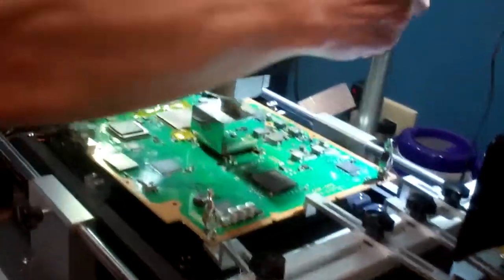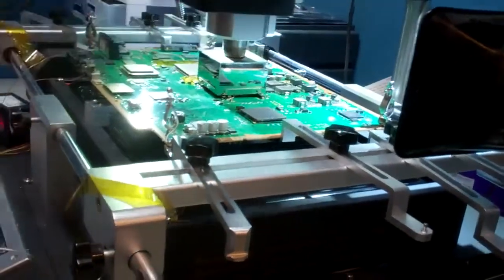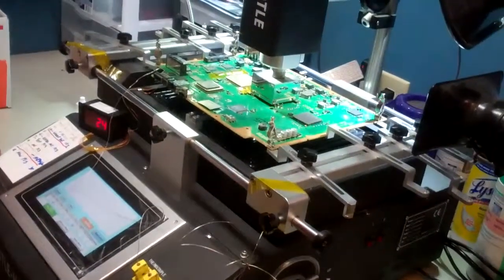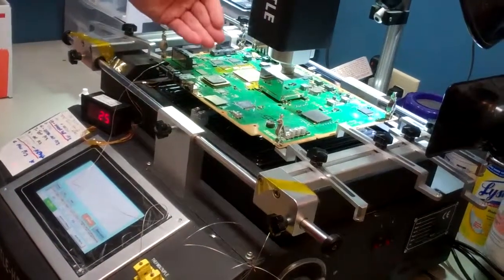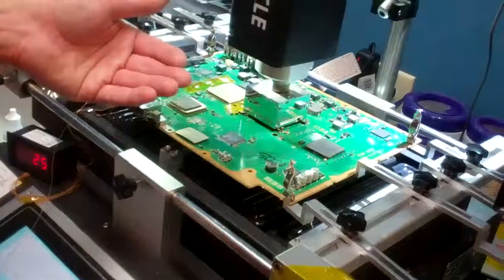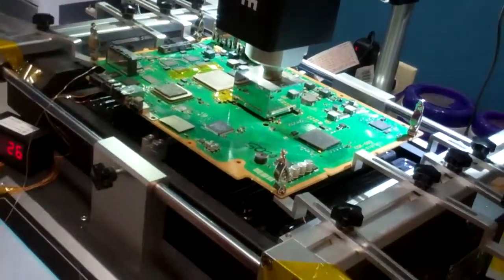So now we're all set up in place. We can position our upper nozzle and start our reflow. So that would be how you monitor the PS3. We're going to make another video on the Xboxes and how you probe the Xbox. Coming in from the CPU side about five millimeters underneath the heat spreader — that's the position that you want to reach the reflow temperature. Thanks for watching.